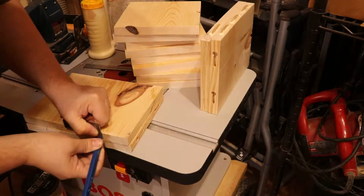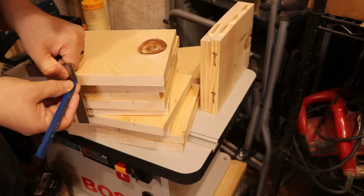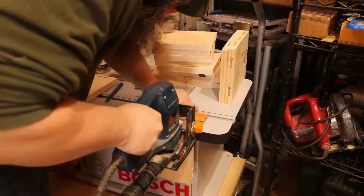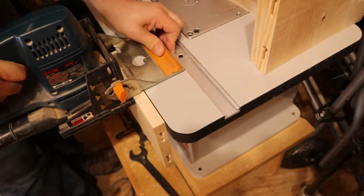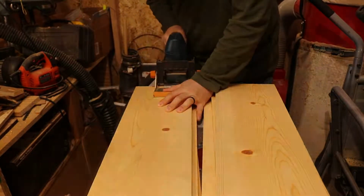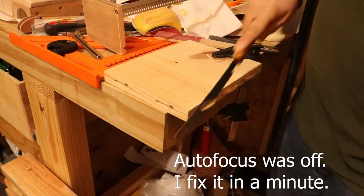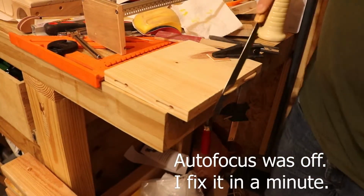I used a square to transfer all of the marks to the correct side for lining up with the line on my biscuit joiner, and then cut the slots on the correct sides. I marked and cut the slots in the bottom pieces without incident. Once the glue was dry on my patch biscuits, I trimmed those flush and cut the correct biscuit slots in them.